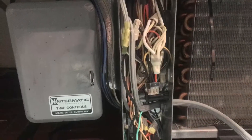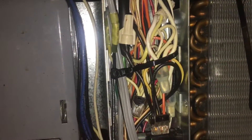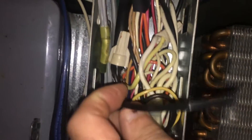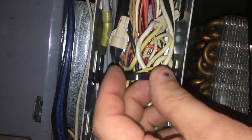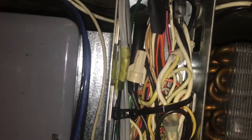What I do sometimes too is use wire ties to keep the wires back, because you got that hole right here — the cover's got to go on and you don't want the wire to rub on that screw. I use a wire tie just to kind of pull the bundle down a little bit, and you can put the tail of the wire tie across the rest of the wires. That way the tail always hits the cover and not the wires — just another little tip of the day.